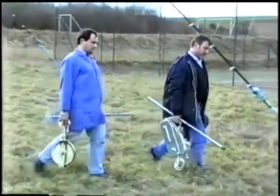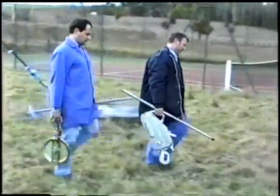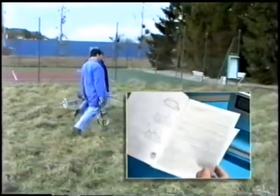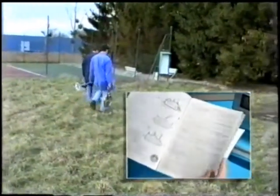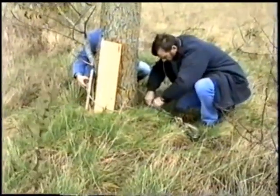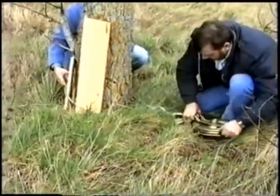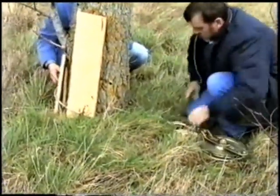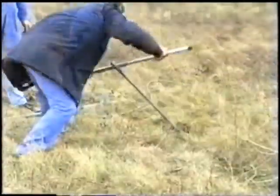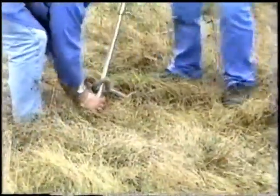Putting the Tirfor to work is very simple, but you need to follow very carefully the instructions set out in the manual supplied with every machine. There is a range of Tirfors, so choose the model which is within the load range and appropriate for the operating conditions. Make sure that the length of wire rope is suitable for the application. Check that the anchor point for the Tirfor is capable of taking the load.